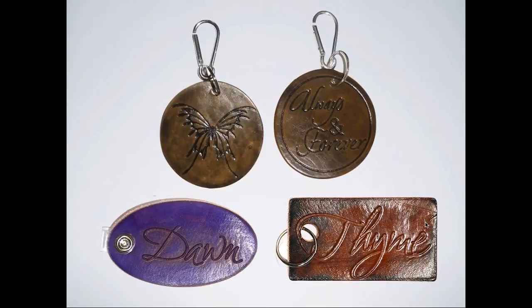When you're embossing leather, although these look as though they are a line rather than a fill, every single one of the 4 designs is actually a fill. The reason for that is because the leather is quite dense and you want intense pressure over a small area, so a tight fill will produce this effect. It's debossing in each case, imprinting into the leather rather than the reverse side that you would see pressed up, and it gives a very effective result, as you can see.